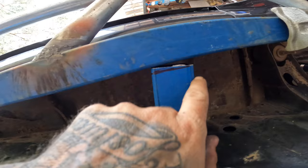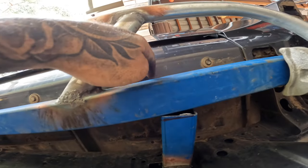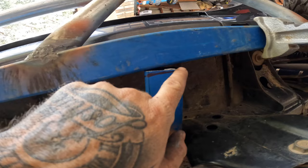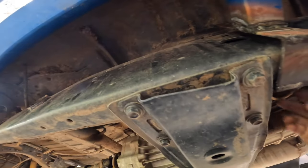This one, because I've mounted it on part of the chassis and it kicks, I've actually got to cut this on an angle to close that gap and make it weld a bit better. It does have to come in a little bit. Down that end I'm running along — there's like a body mark along there. I'm touching it — it's about five or ten millimetres — so that should give me enough to bring it closer and be able to mount it.